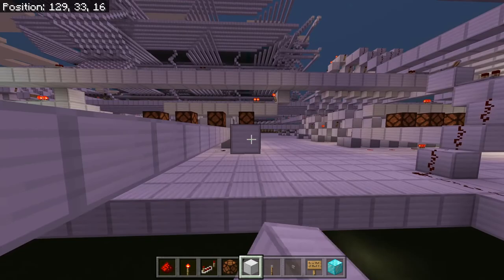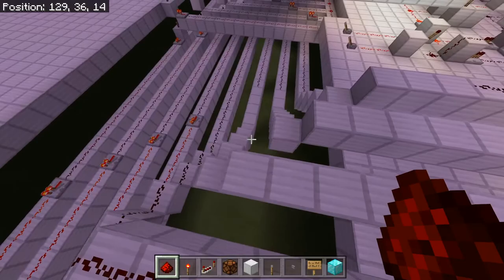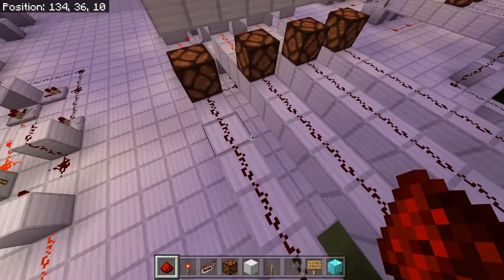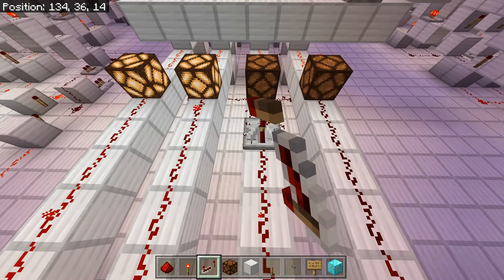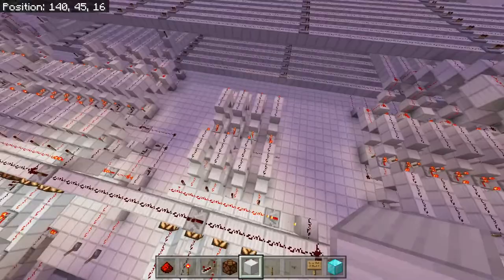Okay, and our data coming from memory at the moment is all ones, which is going to be useful because it will allow me to work out where these repeaters will be needed. So, first repeater is here. Next. And that's a nice pattern going across. That's good. And then these will need repeaters just at four. So that's the basic setup for our opcode register.